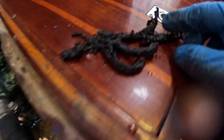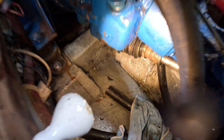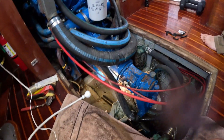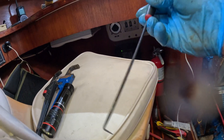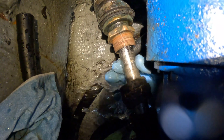Okay, we have all the packing out and I want to show you this — see how bad it is? It looks like it's all worn down. That's just old, old packing. I went ahead and took the nut off, and I have this tool right here — it's like a pick — and I get in the nut and dig out all the old packing. Once one of the packings is out, the nut will flop around.